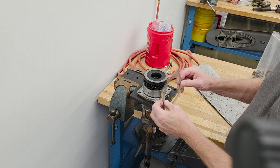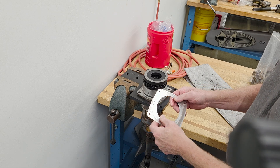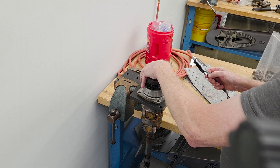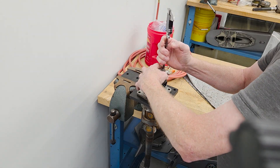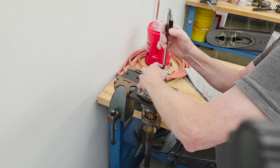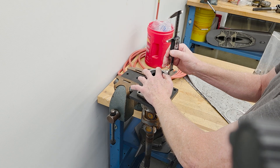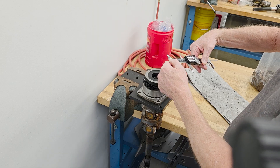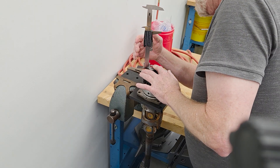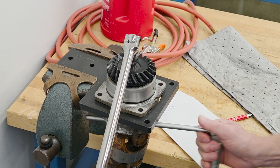So this is the DPS D1. We're going to put the shims back in when we reassemble it. I'm going to measure and make sure everything looks the same - this is a pretty much brand new gear case and I want to make sure everything goes back to the same spec. I'll zero my digital caliper, measure a couple of locations that match our chart dimensions. Dimension reads 7.65 - I'll write that down. Now let's slide this through the yoke.